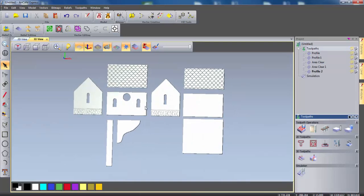The next thing you'll need to do is assemble these all together. You can use wood glue which is safe for birds, or nails. But don't nail down the front roof section — use a hinge for this, which can be leather, a non-rust hinge, or even some rubber from a bike tyre, because you'll need to clean this box out in autumn.